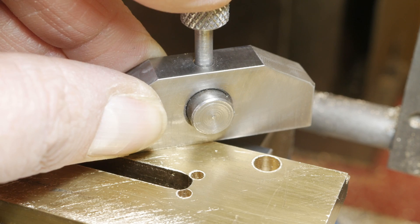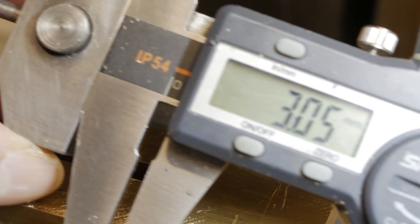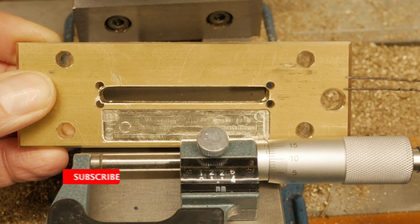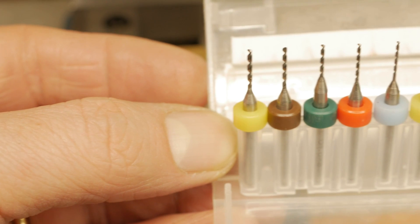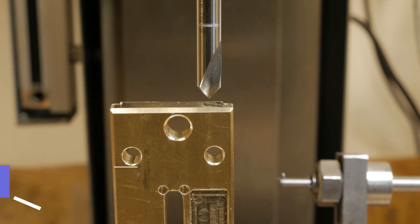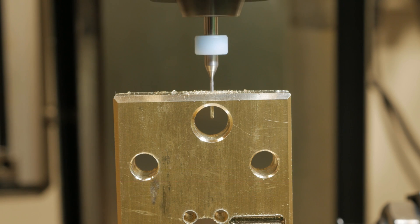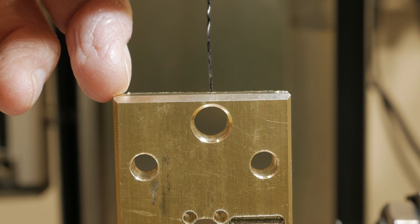The final idea came when I decided to slide the cursor with two guides of different heights, and in that moment the idea to make a small hole arrived in my mind. I did not think I'd be able to make a 0.8mm hole in the steel. To avoid breaking the tip I drilled a hole from the center deeper than usual, so as to not only give a better guide to the tip but also allow the discharge of the chips.